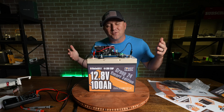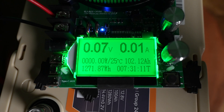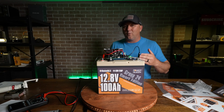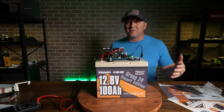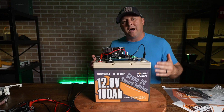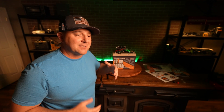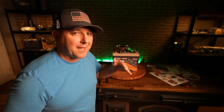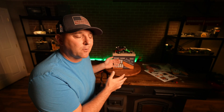The results are in: this 100 amp hour Lithium Iron Phosphate battery returned 102.12 amp hours, about 2% higher than its rated value. One thing to keep in mind is that pulling 185 watts is only about 0.15C, or 15% of the battery's capacity. Typically we'd want to pull 0.2C — about 260 watts — but my heatsink maxes out at 185 watts. Also, this battery is only rated to output a maximum of 100 amps, which limits AC inverter loads to about 1,280 watts. If you need higher loads, you may want more than one of these batteries.